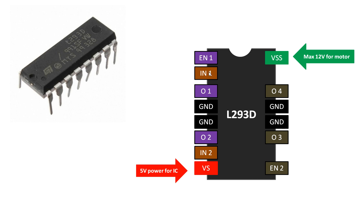On the left side, pin number two and pin number seven are IN1 and IN2. As you know, an H-bridge always operates using four inputs. IN1 and IN2 are the two inputs for gate one, and on the right side we have IN3 and IN4 — the two inputs for gate two. In total we have four inputs: IN1, IN2, IN3, IN4, because every H-bridge requires four inputs to operate.